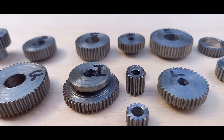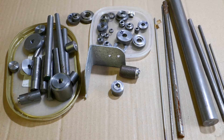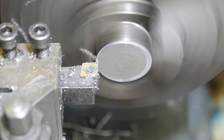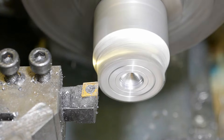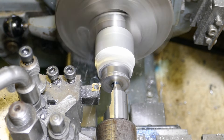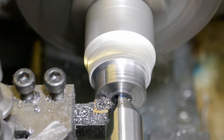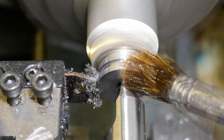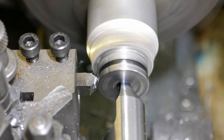Having machined all the gears, the next job is to make the dog clutches. These are splined to the main shaft and engaged with a selector fork. I'm using my stock of off cuts to find some scrap steel. I'm supergluing them to the mandrel — the first job is to face the mandrel flat, then the blank is superglued on. The part is then machined on its face and outside diameter. The slot for the selector forks was machined using a parting off tool with plenty of cutting fluid. I finish the sharp edges with a chamfering tool, always one of the most satisfying jobs.